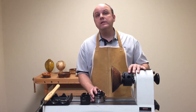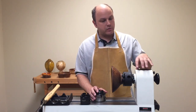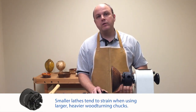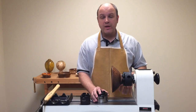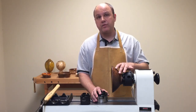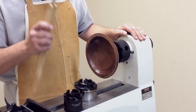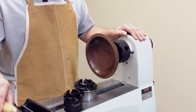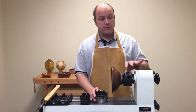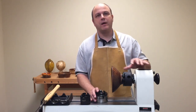Why did we decide to create one out of aluminum alloy? Well, real simple — if you're like me you start out on a smaller lathe, and when you put that heavy chuck on that lathe the horsepower is generally a half horsepower, and it takes a lot of strain to get not only that chuck but also the blank that we're trying to turn up to speed. I also found out that when you lean into it and start turning aggressively, it starts to slow down, and the heaviness of that chuck takes that motor a little bit longer to get back up to speed.